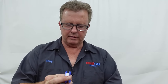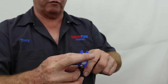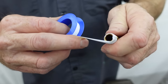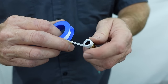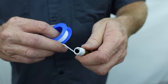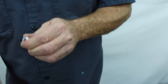I'll show you with the white tape — it's no different. The only difference is that since it's a little thinner, you may go four to five wraps. I do the same technique: I come right over here, overlap, and as I'm doing that I'm pulling it tight and stretching it a little bit so it actually overlaps that edge. Sometimes take your finger and just tap it down. There's my three wraps — I'll give it another three back here, then go back across one more time for a fourth, making four to five wraps altogether.